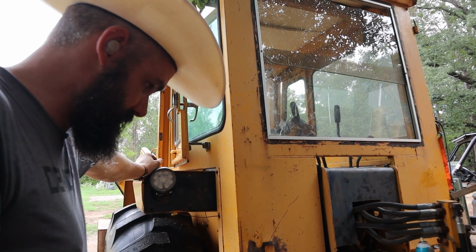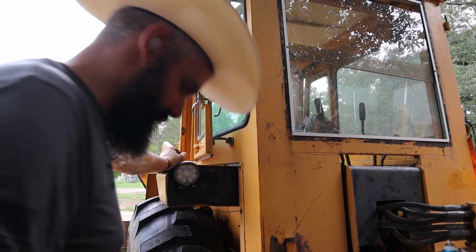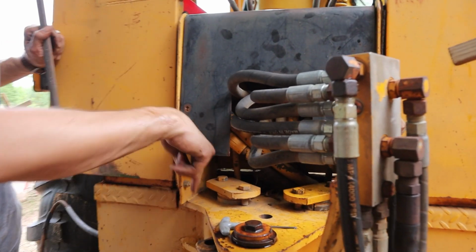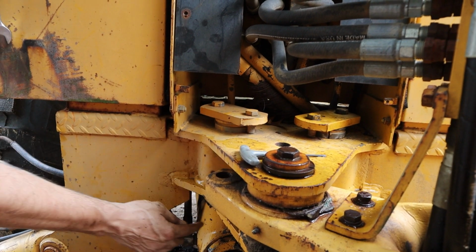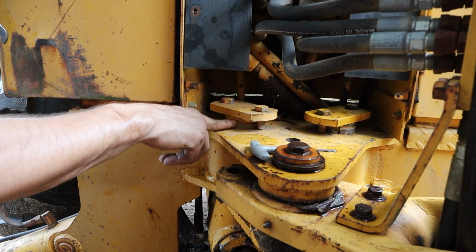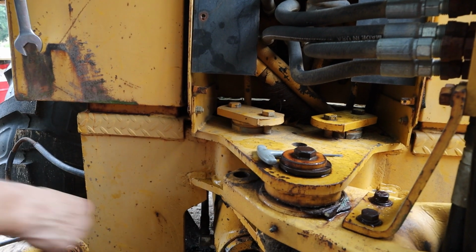Alright. Let's pull the cylinder off, which is a challenge in and of itself. Let me tell you. Here we go. Yeah. So, this is actually a pretty clever design. Basically, you've got a pin that comes through and stops right here, because it can't go all the way through, obviously. But there's a pin in here, and the way that it sets up is as it wears, there's a taper on this pin. And it doesn't sit all the way down at the bottom. It doesn't bottom out in here. So what this is right here is a pressure plate, and there's a collar right here that is also tapered. So as you screw this down, it forces the pin down, so it'll eventually stop. But then as the unit wears, you can just tighten this and it'll tighten those up.